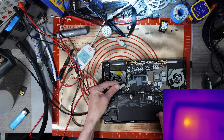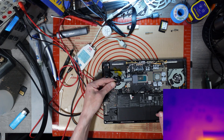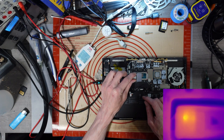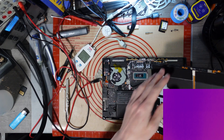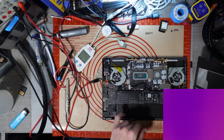Come to think of it — someone has already replaced it, haven't they? Someone's already worked on this. Looking at that, it looks like this has been replaced already, and that doesn't look like factory solder either. I think this is probably a CPU issue and I don't think it's worth me continuing. It could just be a failed MOSFET replacement. Whoever's done this knows what they're doing — those jumper wires are a little rough but the work shows some skill. You can very visibly see it's directly on the die. I think what's happened is someone's done some work on it and probably killed the CPU.